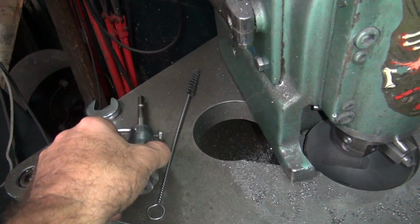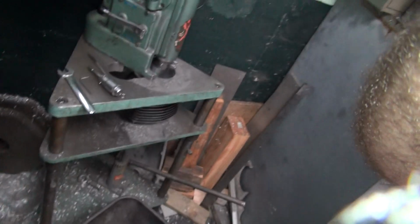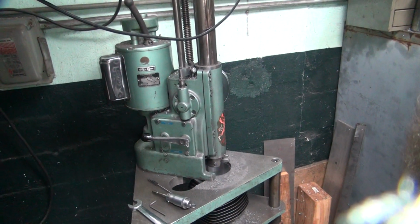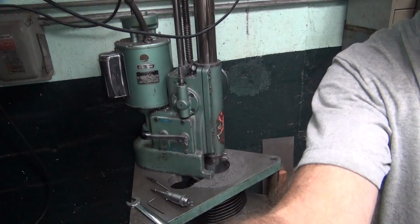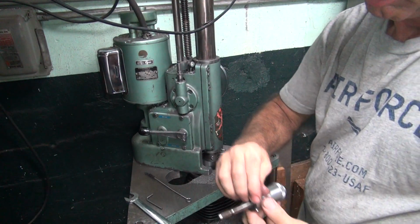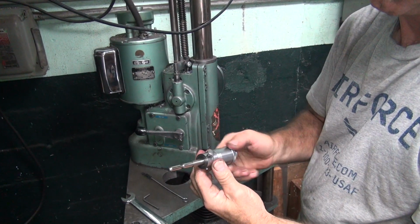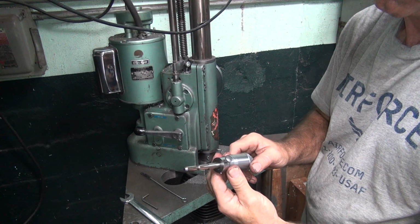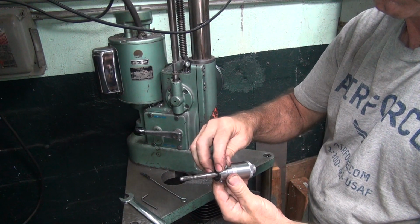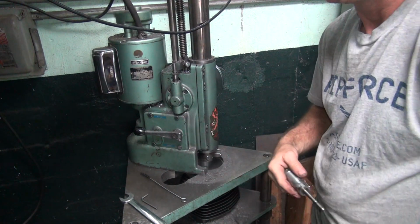We're going to go ahead and take our indicator and move it out for a bigger cut. I'm going to take a big cut this time, rough it out almost all the way. We're cutting 60 thou out with a bigger piston. So we're going to bump this thing up a bunch. So there's our 20, 30, so we go to 29 next pass.